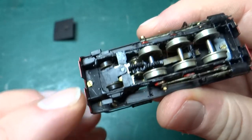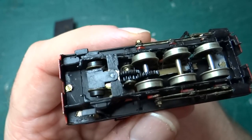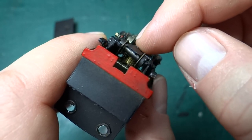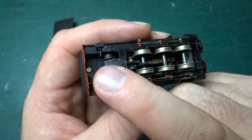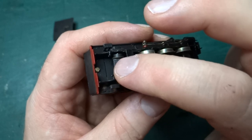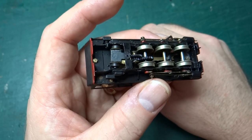The pony truck that carries the rear wheel is also not from the kit, because the one in the kit is for a different gauge — it's ever so slightly wider — so the instructions basically tell you to cut it into bits and reassemble it. I made a simpler one: a piece of brass with a tube soldered to it, which then has the axle through it. There were also slight issues in that one set of wheels is live to the chassis, so with the pony wheel free to swing it can touch the chassis with either side of the axle and cause a short, so I had to add some tape under the paint behind there to stop that shorting out.